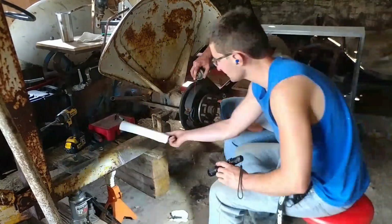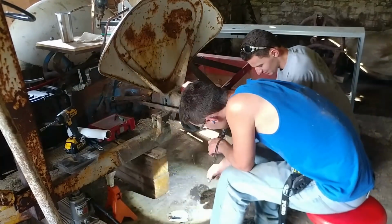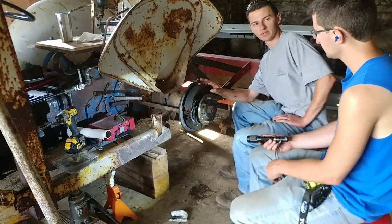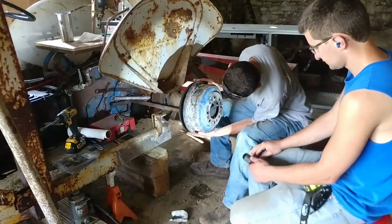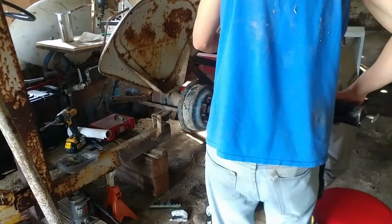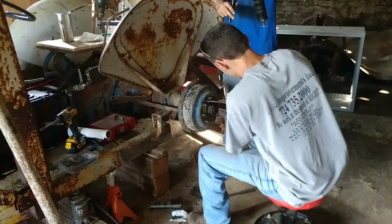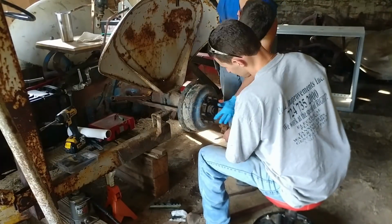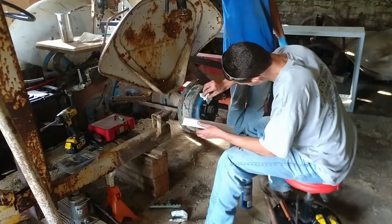Now, also, the pads had worn away about a 1/16 of an inch of steel on the inside of the drum. So if you ran your finger across it, where this pad ended, there was about a 1/16 of an inch lip there. So at some point we may replace the pads and replace the drum, as well as the wheel seal, or the hub seal, I guess that's what they call it. And then hopefully we would have a working left brake.